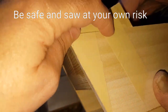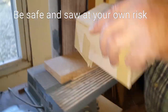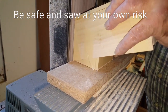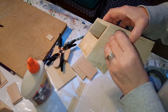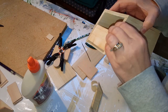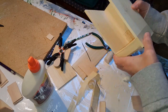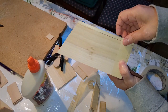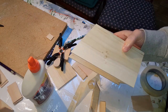Tape it on the side — that'll help you when you go to sand it to keep it at the angle. Once you have that done, remove the tape and you'll be left with the angle. Take out the spacer you put in there, clean out all the sawdust, and then we'll move to the next part.